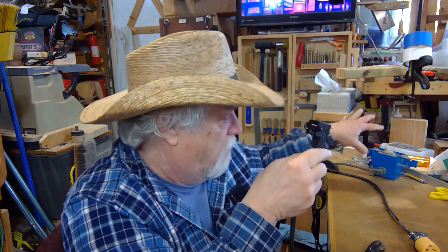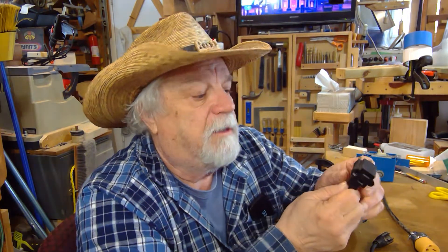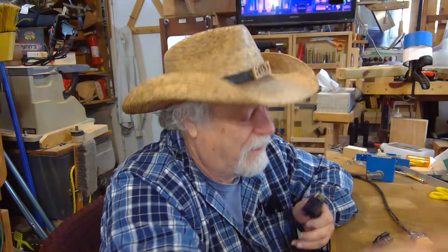This cord — I've never seen it for sale anywhere, but it's a cool idea where you just have a switch inline on a remote cord. Another advantage is I can put a 20-amp or 30-amp switch on here. I can probably run 20 amps easily off this same cord because it's only 10 feet long. If I were running a super long cord, I might want to up the gauge of the wire, but I think this is 14 gauge now, so 20 amps is easy. By switching up the switch itself, I can up the amps. You can't do that with the Harbor Freight remote — that's 15 amps, period. So they each have their advantages and disadvantages.